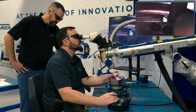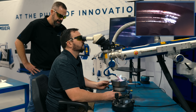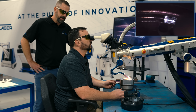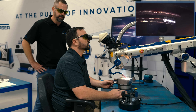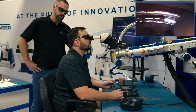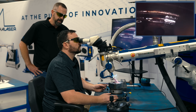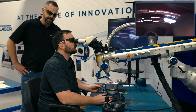On this part, we have to build up the inside diameter — 10 thousandths per side. So this is like a shutoff for the cavity. What happens with plastic injection molds is once they wear — think about a river, how the water rounds a stone — the same thing happens to these molds. As the molten plastic flows over corners and edges, it tends to round those corners. Over time, that causes a problem where the mold doesn't shut off or seal completely, and you'll have flashing or plastic leaking out of the mold, which shows up on your part. This repair takes care of that.